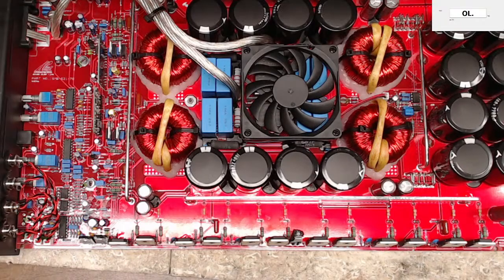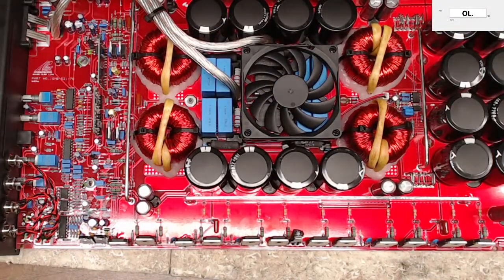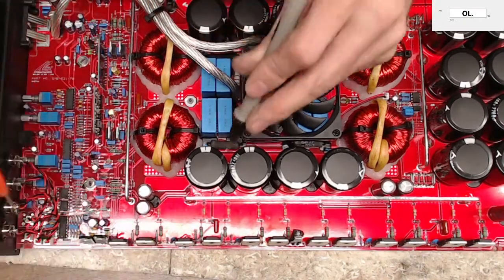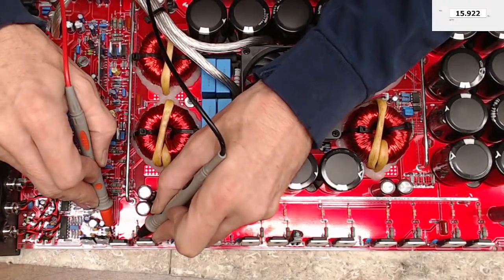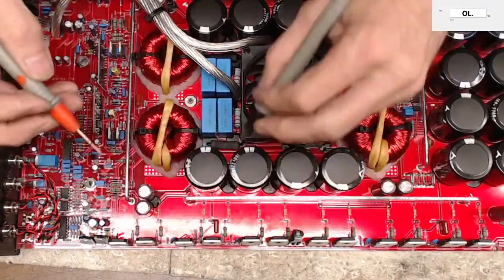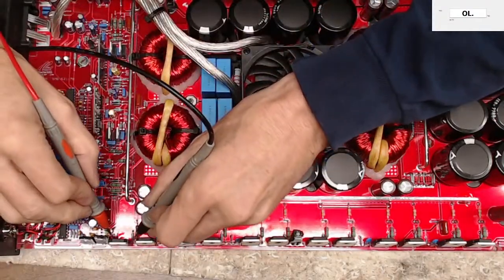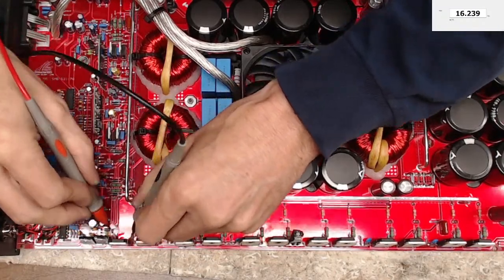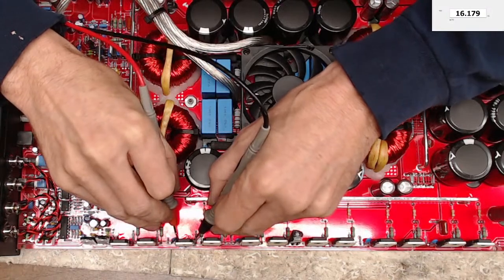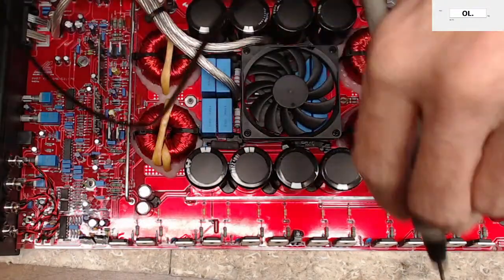And now the final thing I do is I double check the resistance values again after all the transistors are put back in. Now remember, it goes back to what we're looking for are the resistance values. Which was, what was it? 16 and 8, right? Again, it's going back to my bad note-taking as I drag my leads across all this thermal paste. I know I fix amps, but I can't stand thermal paste. What do we got here? 16K. So the first three sets should be 16K. And then there's our 8K. So it's going to go 16 for the first three, 8K for the next three.